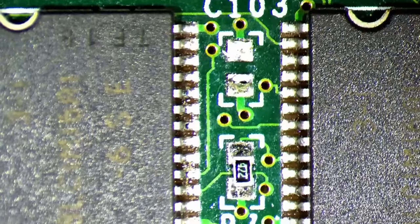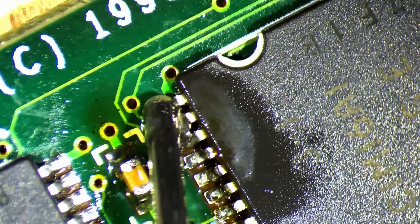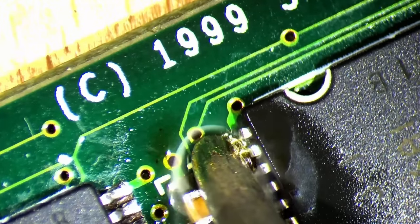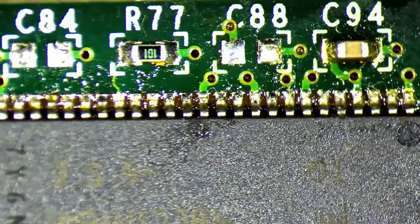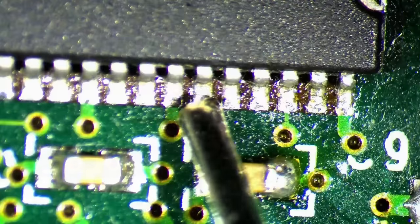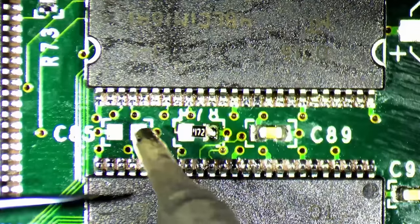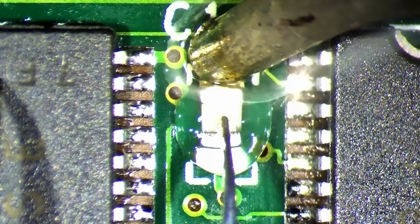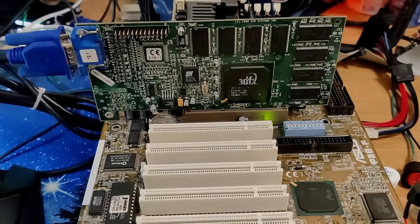Before we can test the card, I went over it to see if there were any other issues — and there were plenty. There were some solder bridges on one of the memory chips which had to be fixed. This is usually an indicator that someone else was here with a soldering iron. This suspicion is reinforced by the residue of flux around some SMD components and other memory chips. I wonder what has happened to this card, since there are also some capacitors and resistors missing. Maybe this card served as a donor, or were they just knocked off? Whatever the reason, we have to get all those resistors and capacitors back on the board. I tried to get the correct values from high resolution pictures or by measuring similar looking components and clusters nearby. Once I was confident the card was ready to be tested, I plugged it into my ASUS P3BF for the first test.